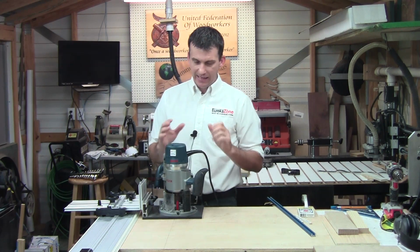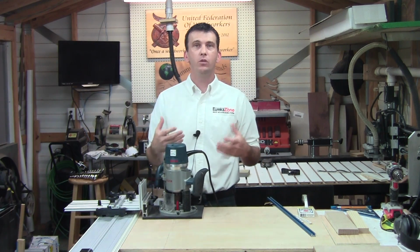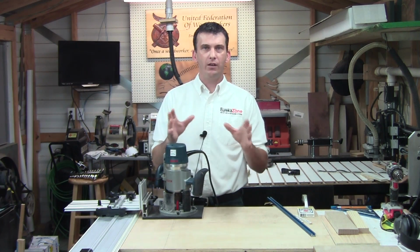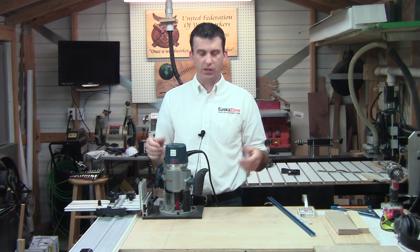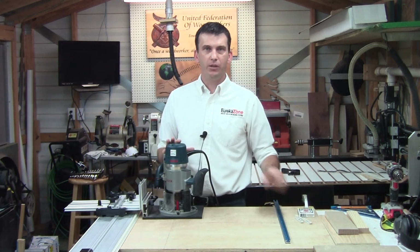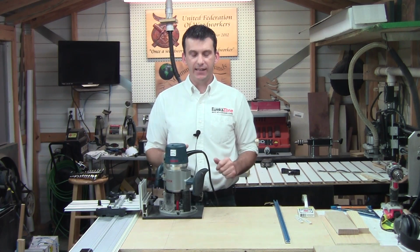Okay? And in this instance, to make it simple for me, when I do all of my Rabbets, Dados, and Grooves, I work with a 1/2-inch router bit. You can work with whatever size router bit that you want, but I work with a 1/2-inch because it makes my setup so much simpler, because the little aids that I use, and I'll talk to you about those in a minute, will help me quickly set up for my cuts.